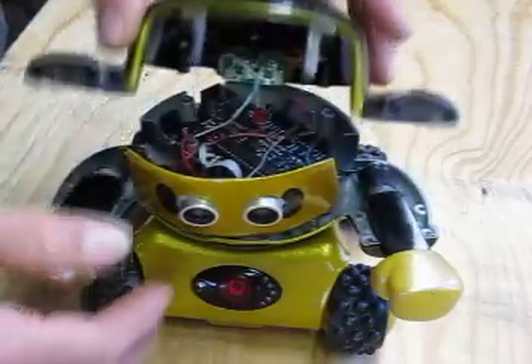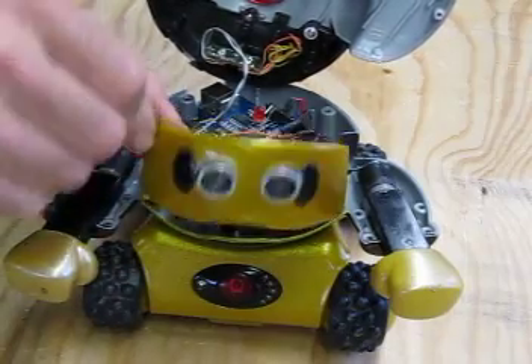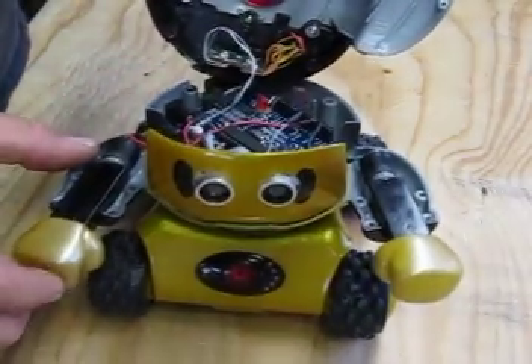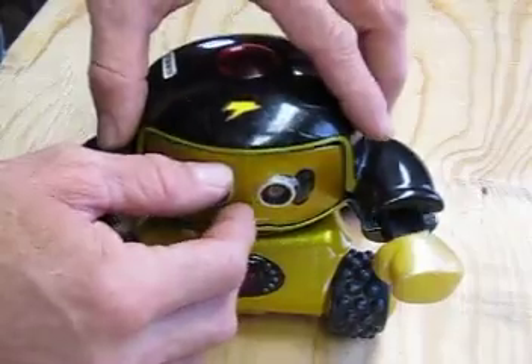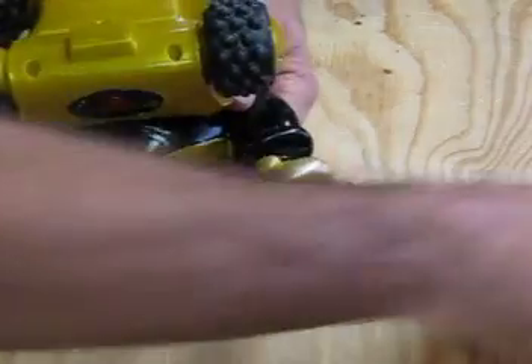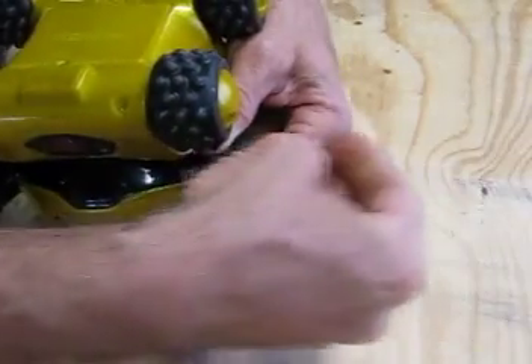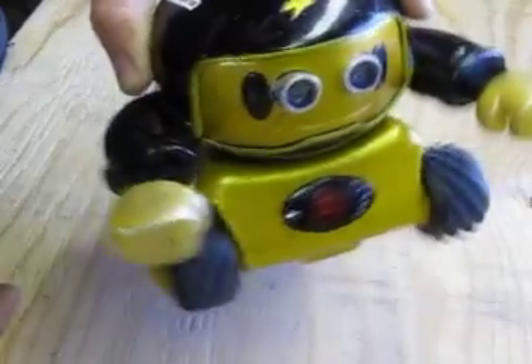I've managed to cram everything inside the head. Got the flashing LED that goes off when it scans, the ping sensor mounted in its face, and the buttons — left and right bump switches — all mounted and connected up solid. Now we put the head back on, get some screws in the bottom, and we'll be ready to roll across the floor and see how it does. We've got the robot back together, code uploaded, and I'm going to turn it on. It starts — bump switches work, ultrasonic's working. Let's put it on the floor and see what happens.